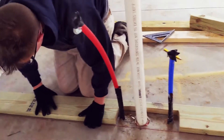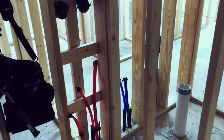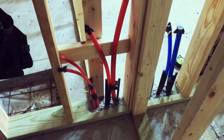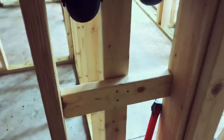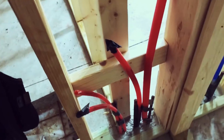My plumber had a whole manifold of pipes that go all the way over to the utility room — they pop up in the bedroom side of the house right at the wall intersection. I could have put a standard three-stud corner in but I had to get a little creative. I used this technique that's a lot more common in advanced framing, where you put these cross pieces in to build the corner. That lets you tack drywall to it and also gave me tons of room for my plumbing. So all the plumbing fit.